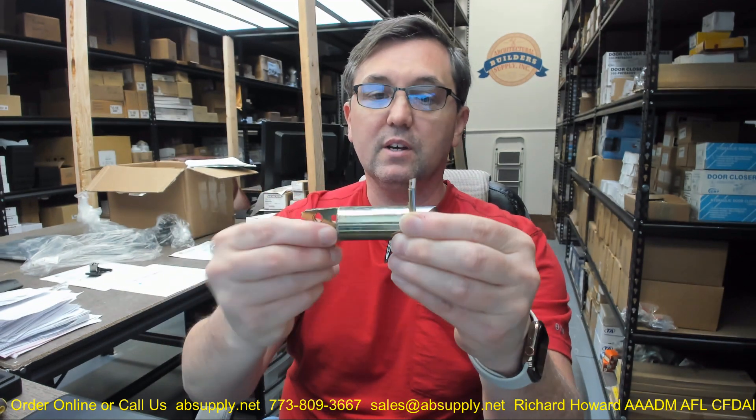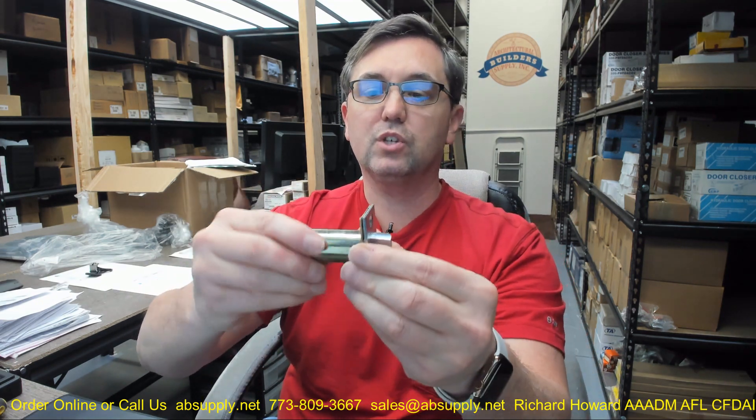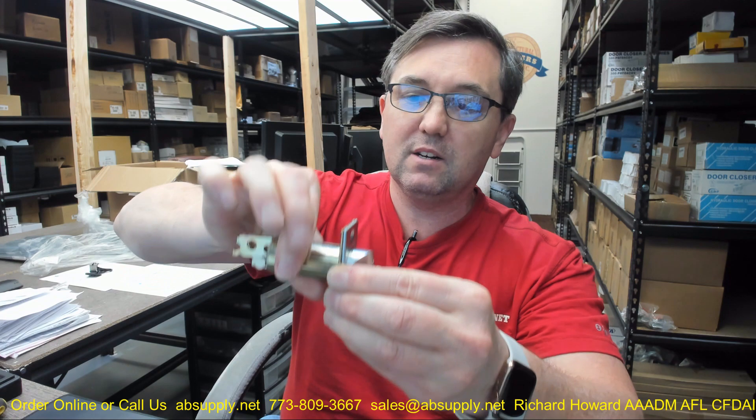This certainly works just perfectly and I can rotate this. In all fairness, it doesn't rotate very smoothly — I have to kind of push it together. You can see I've got a bevel set on that latch bolt and that's how I'm turning it, even though it will install square as well. In all fairness to you and to Schlage, it doesn't rotate just super smooth. I am literally putting bias on the face plate back this way and then I'm able to rotate it cleanly.